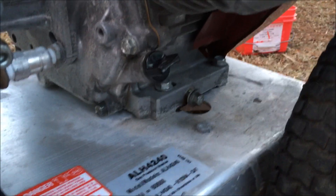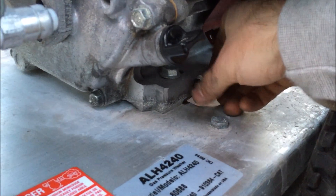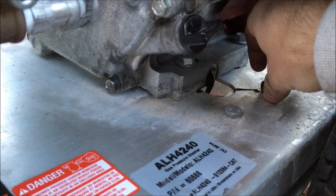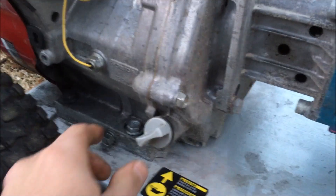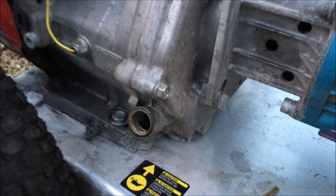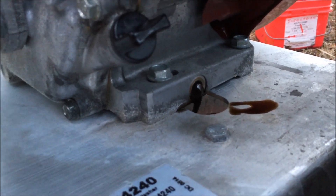I've already loosened this. I have a bucket underneath here for the oil to drain into, and I got the pressure washer lifted off the ground a little bit. You're just going to get this unscrewed, and as soon as you pull that thing off it's going to start coming out. What you can do to help that flow out is loosen your dipstick and get the air going.